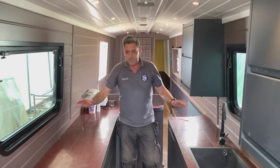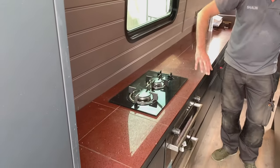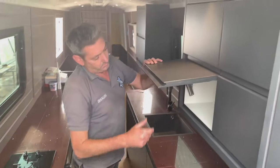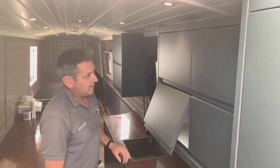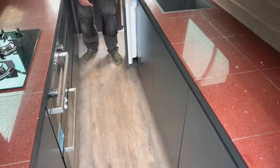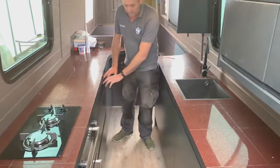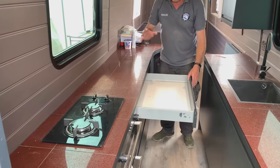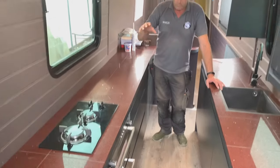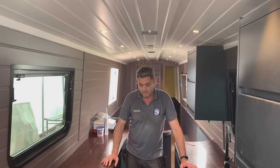Okay, right, so we've now got the worktops in position. This customer wanted tile worktop, so we've had the edge polished and we've edged it under some plywood. So here we've got the small wall units with slow closers. There's four on there and two on there. Here we've got the integrated fridge. Obviously the sink. We've got 800 mil, which is slow closing drawers, because if they don't hold with a narrowboat in particular, the drawers could slide open unless they're on a slow closing system.